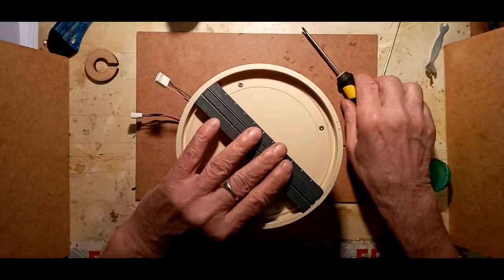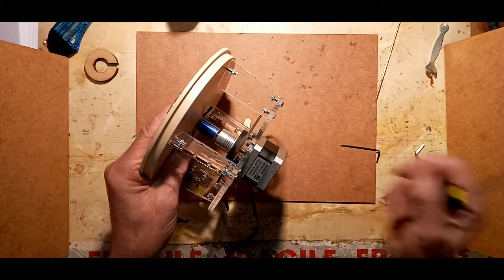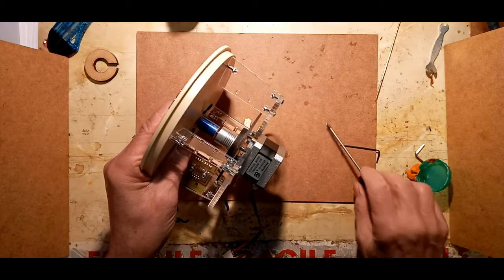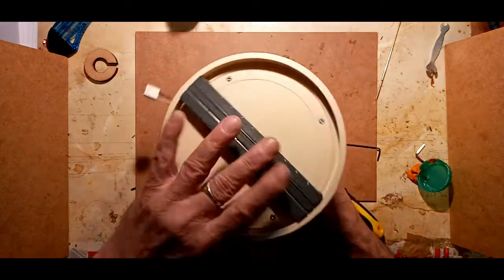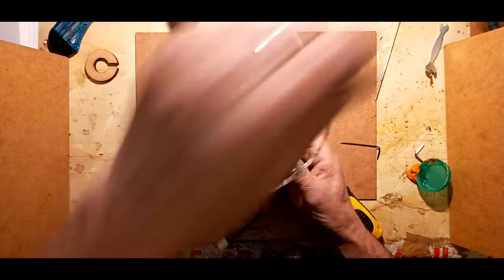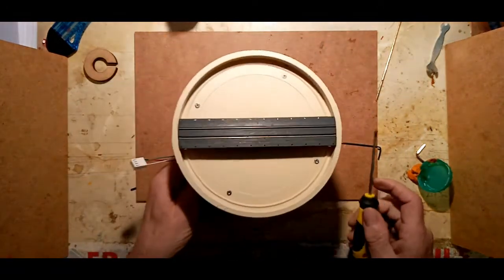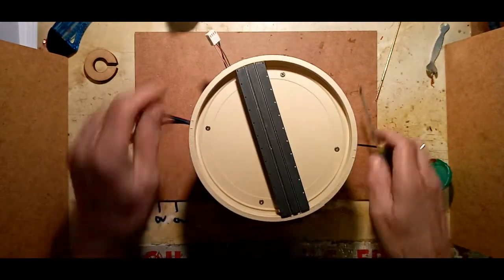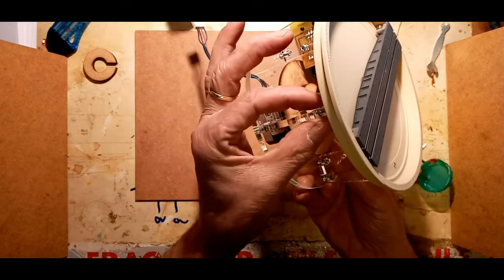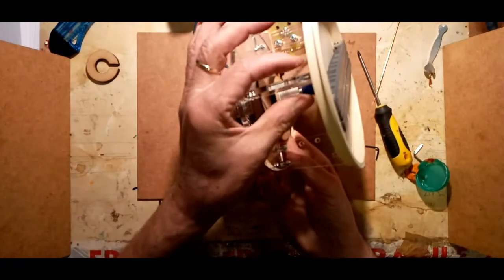Now you need to go around and just back off the ones in the bottom. Just sort of half a turn so they're a floppy fit. And you've got the top ones which are a floppy fit, so the actual pieces are quite easy to move and float around. It's got to find its own level now. So with it flat on the table, first thing is to get the top ones done. So if you just grip where the nut is either side, as I'm doing there,